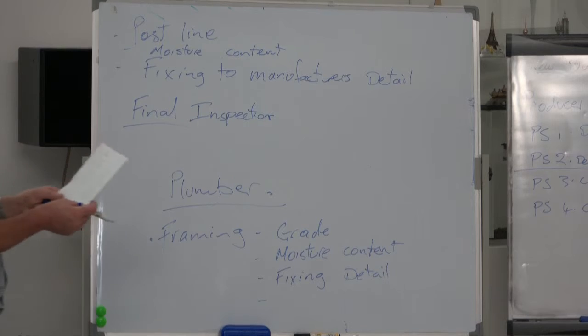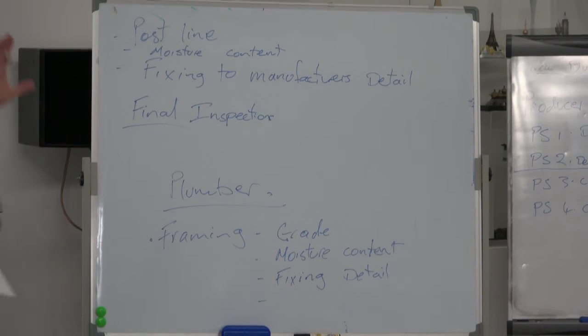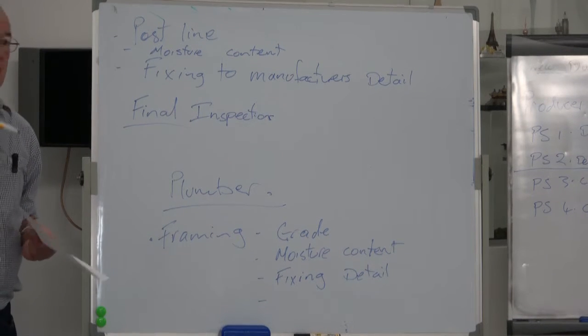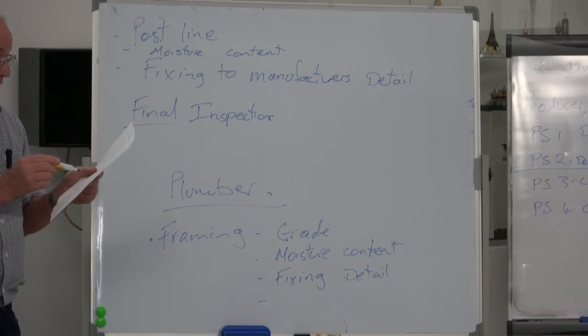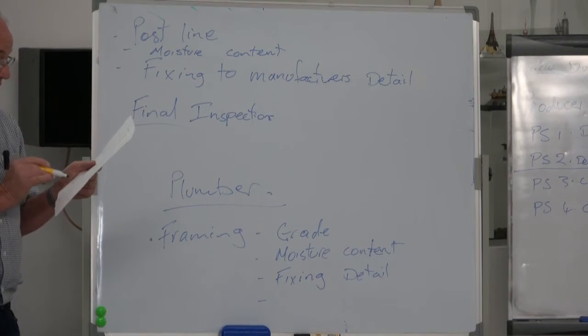So surface water is another one here. External moisture. The building inspector will look at all of the cladding on the outside to make sure there are no holes or gaps. Scribers on the windows, if you have to have them. Flashings are in the right place. Flashings on the roof. There is a huge amount in there. You won't need to use the hazardous building substances.